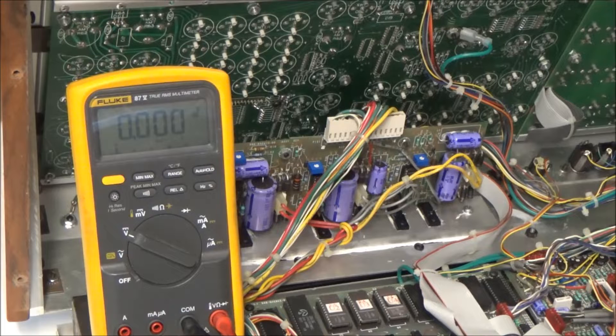Because the fan uses DC instead of AC, we're going to need to connect the fan to the synth's power supply, or somewhere down the line from the power supply. I picked a fan that I can connect to the 5-volt unregulated rail for the digital power supply. That way, nothing that I do with the fan will have any chance of interfering with the audio path. The Memory Moog power supply works pretty hard to begin with and generates a lot of heat. The more current you draw on a power rail, the more heat the linear power supply will generate.